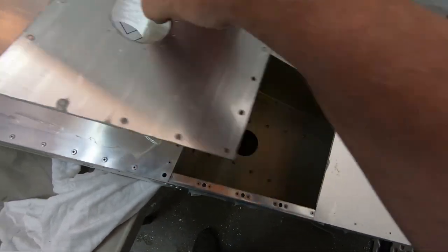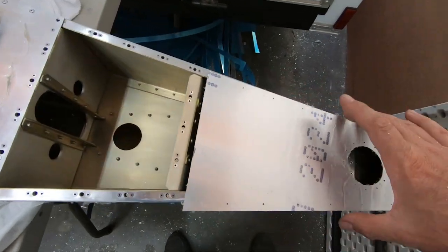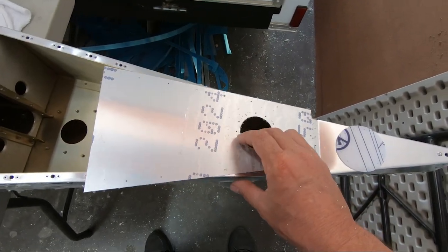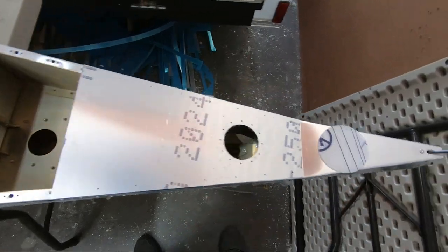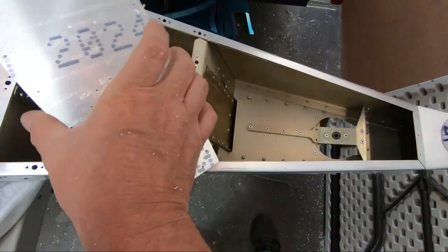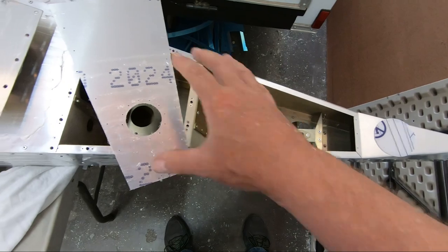I'm going to go ahead and put a sight window here exactly the same as the one in the front. I cut this panel to fit exactly where the Lexan panel was supposed to be and pre-drilled holes for the screws, similar to what we did with nut plates on the front panel. I'm going to get this inspection window riveted into place, then lay this out and mark the screw holes that need to go here, get it lined up, and drill out these sixteenth-inch holes, then start finishing and prepping these holes for the nut plates we're going to install. I actually like this setup — I think this is going to work really well having a solid aluminum cover with an inspection hole that can be removed just like the one in front.